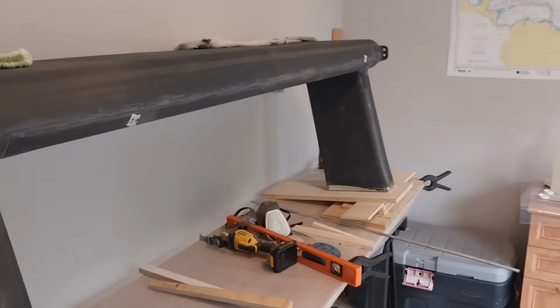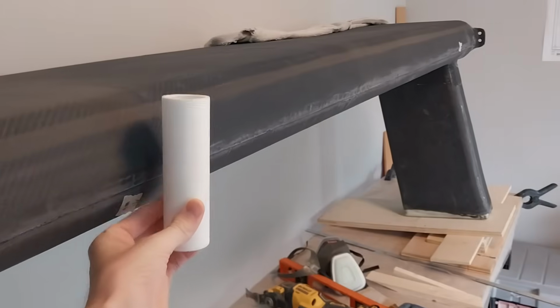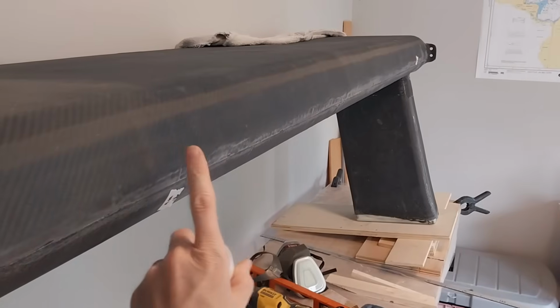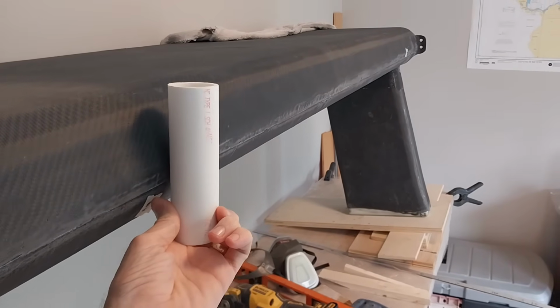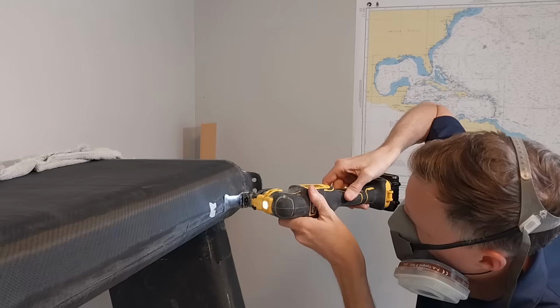And then if I use my level on these housings when I put them in position, I can try and hot glue them perfectly perpendicular to level. And I think what I'll do is I'll cut out about 1/2 inch of material so they can sit in there better. So I'll hot glue them level and then go back with epoxy fillets to really put them on.